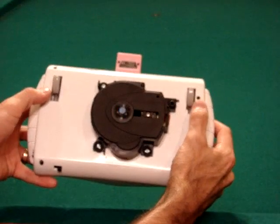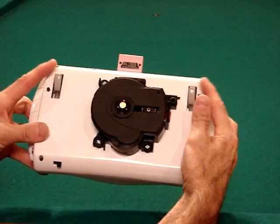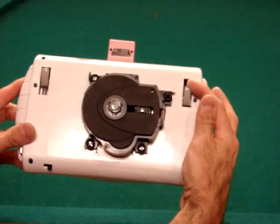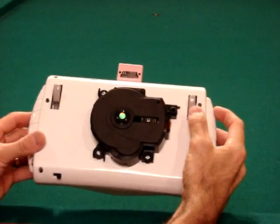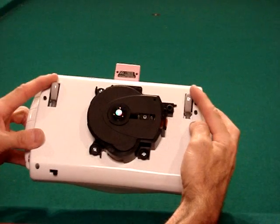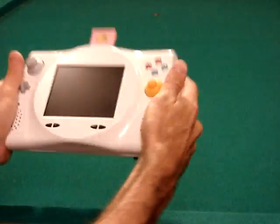These are double Z buttons and they're just normal tact switches. Here I've got two analog triggers. The GameCube system is a little different — it has analog triggers that at the end also have a button click in them. So I had to severely modify a Quantum Fighter Pad. I took the triggers out of those, put switches in the end, and modified it so it had the right resistance to work properly with the GameCube.